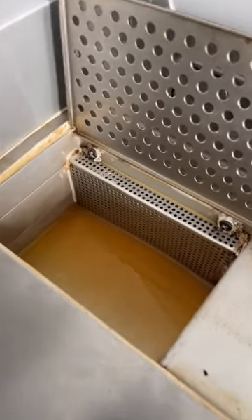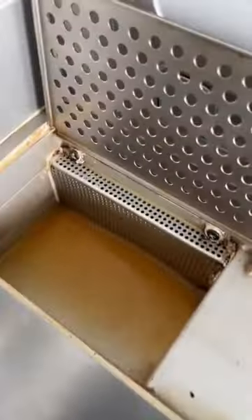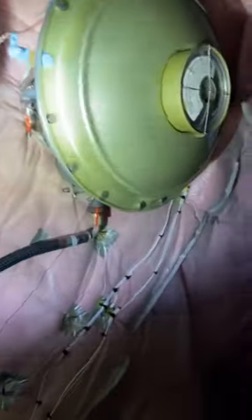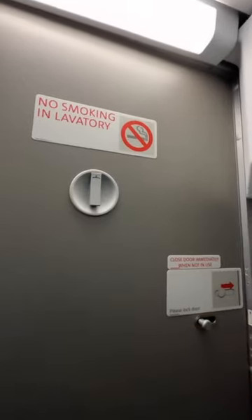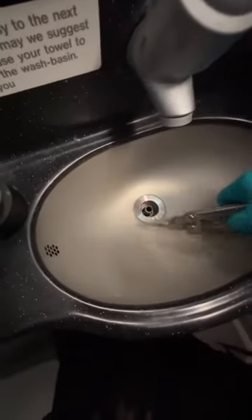Water is also provided into the galley systems. Here's another clog we found right here — this is the back of the Airbus 321, the aft galley. Behind these panels you can see the check valves, the pressurization safety check valves, as well as the chiller — that big white box. The concern here was the drain itself. I get the question a lot: what are maintenance personnel responsible for? We're actually responsible for everything — from toilets to tires, seat recline to lavatories to sink drains to aircraft systems. We troubleshoot, we fix, we make sure the aircraft is airworthy.